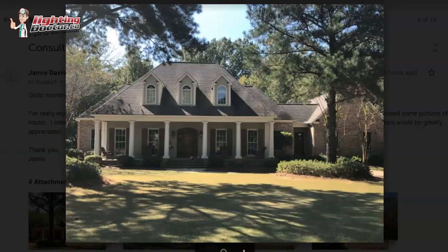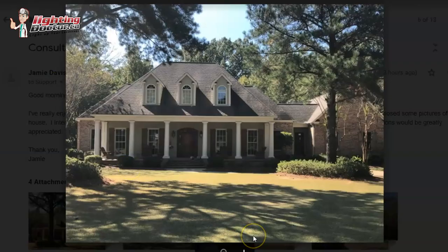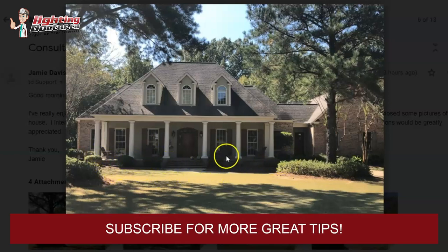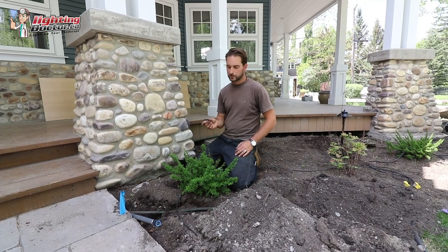On the front of the house I would suggest using a larger transformer — probably a 300-watt transformer. Not that a smaller one couldn't handle those lights, but it gives you the option to upgrade and add things, which I can almost guarantee you'll want to do. Sometimes what I'll do in an area like this is add path and garden lights in between where the columns are lit — one in the middle, a couple on the sides — to create a nice balance of up lighting the columns and some down lighting below. A bigger transformer would definitely be better.